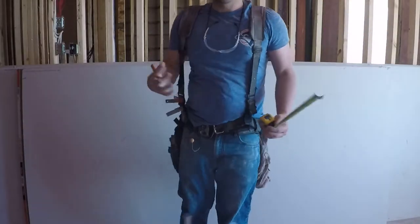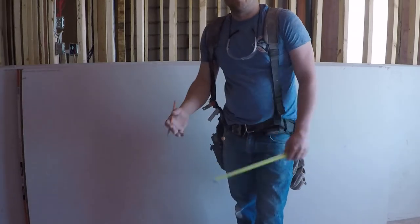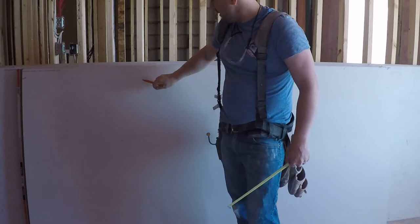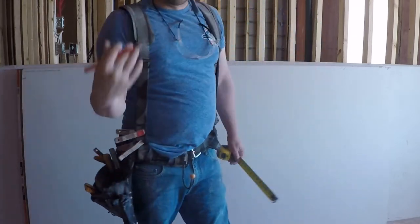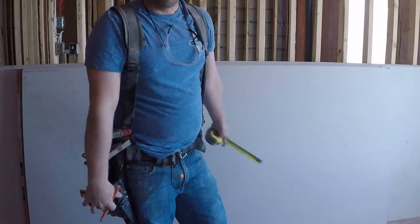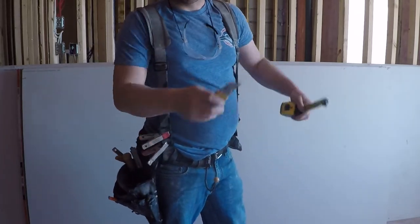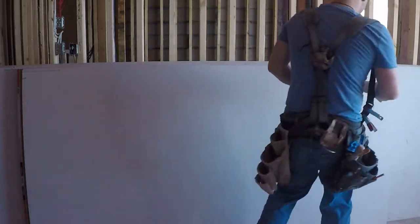When you're cutting returns, you don't want a bevel on a return — never have a bevel on a return. So you cut off three inches first and then do your four-inch strips in the middle. Always cut the bevel off. Don't use beveled edges on returns. Make sure you cut like three to four inches off the sheet when you're doing strips. Don't snap until your strips are cut, otherwise you're going to have a rough edge to run your tape on and it won't line up straight.